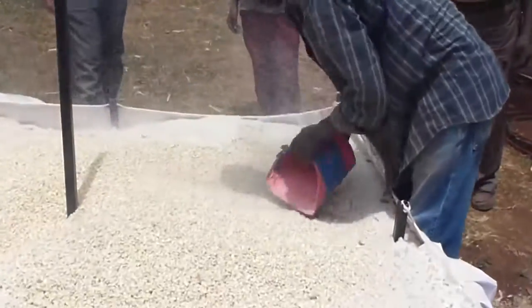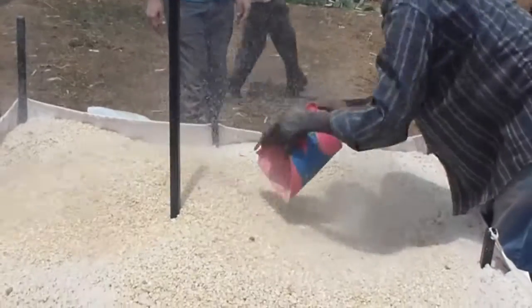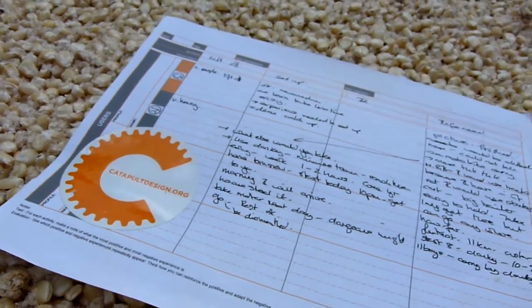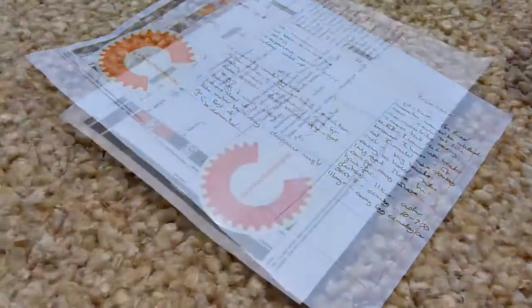To know that you've got the right volume of grain and that you're running your machine at the most efficient level of grain versus air being pushed through, your A4 piece of paper should hover over the top like a hovercraft. This will be an important message to get out to the operators so they know whether they've overfilled their bed or not.